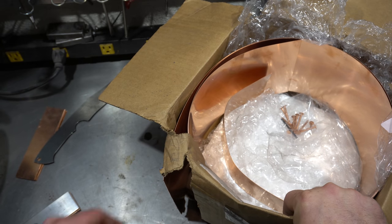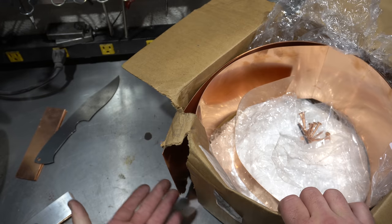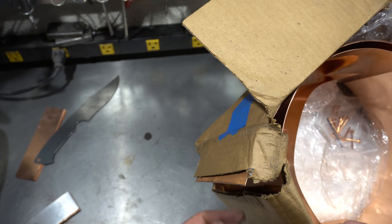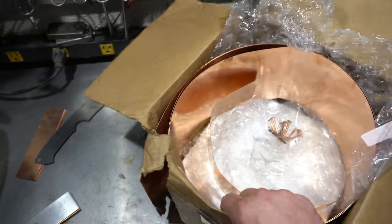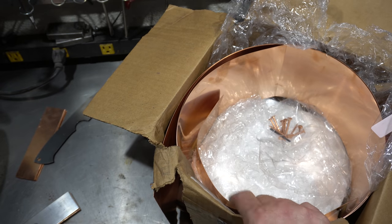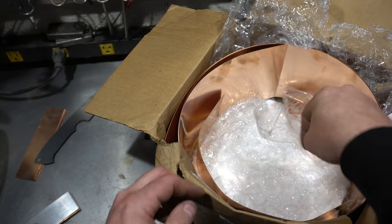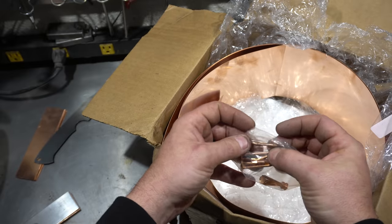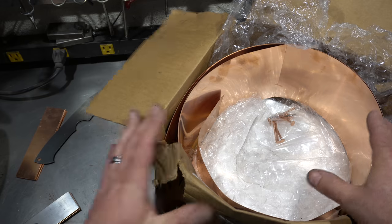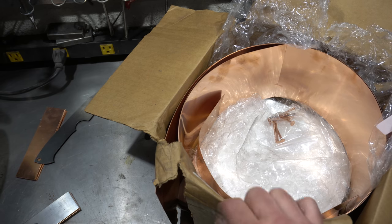About the copper I use: I buy it six inches wide in a big roll, I think 10 or 12 feet long. I like it because most of my billets are six inches wide, so I can just cut off sheets. I cut the side of the box so I can pull it out and keep cutting it off. If I need a really long piece I'll cut it lengthwise. It's much cheaper to buy this way than from knife-making supply stores. I'll put a link in the description to where I got it — it's an Amazon link. It also comes with copper nails which you can use as pins, and a drill bit. Really cheap — I think I paid 80 bucks for this, and a sheet this big at some supply stores is like $15 to $20. Much better value.